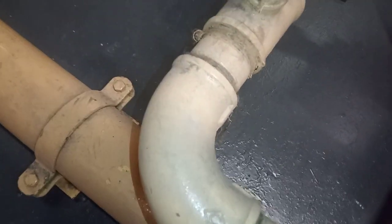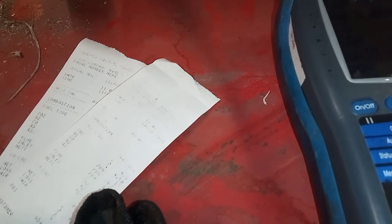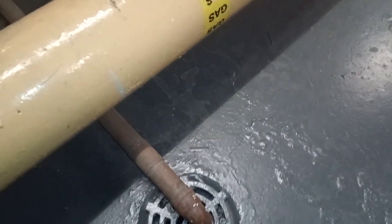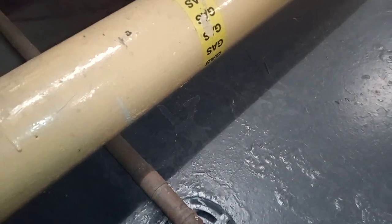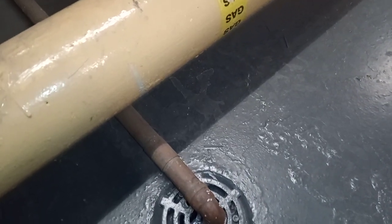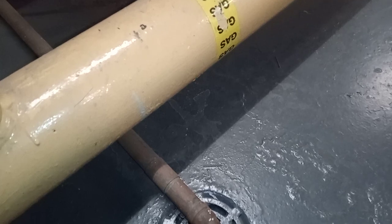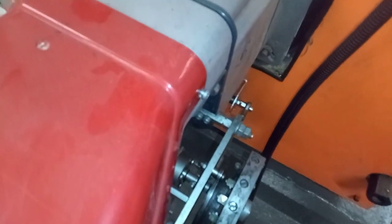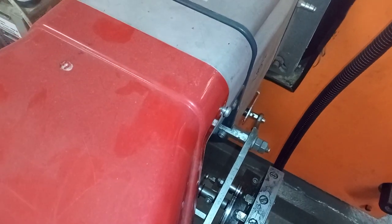Make sure the gas supply is adequately clipped throughout the entire run. Leave your high and low fire printouts on the unit. Check that the PRV is discharging to an acceptable location at the right height and level from the floor. There are a lot of things to check when doing servicing — make sure you read the manufacturer's instructions.